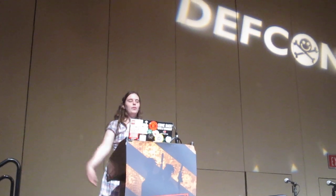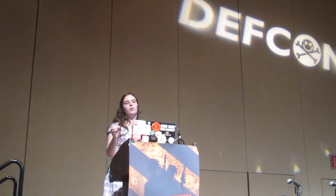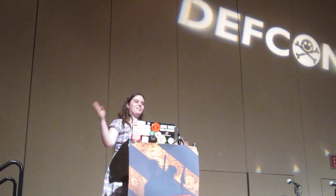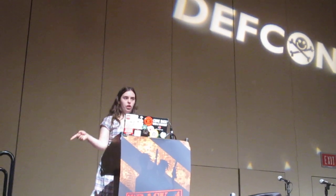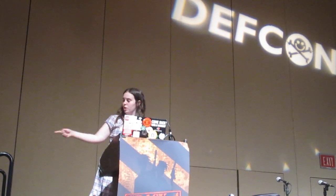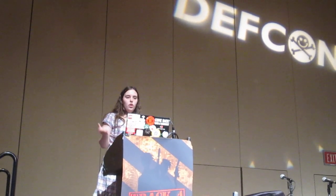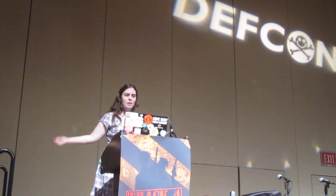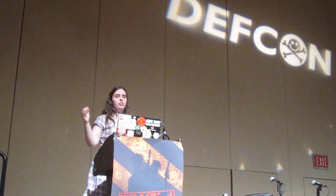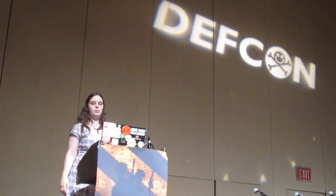The motor direction. So many people slap two motors on plywood and drive forward, even with a PWM, and it lists. This is because brushed DC motors have a preferred direction that they like to turn. If this wheel's going this way and this one's going this way, and the motors are towards the center, the motors are actually turning opposite directions to make them all go forward. And brushed DC motors work better in one direction than the other. How do you know you're using brushed DC motors? Because you didn't pay extra to not be using brushed DC motors.